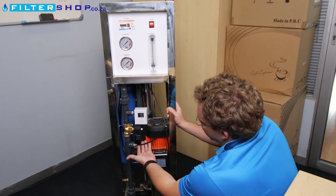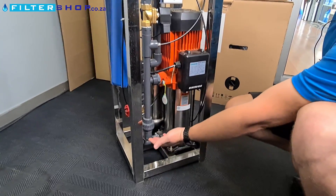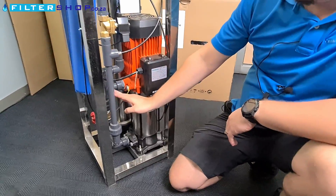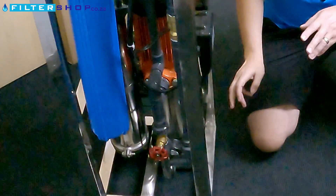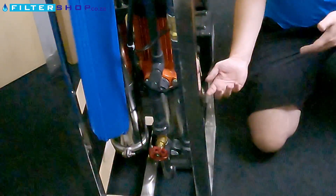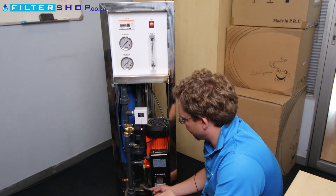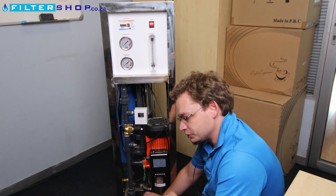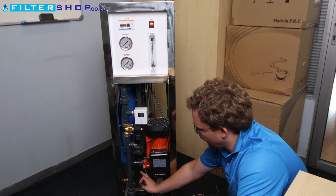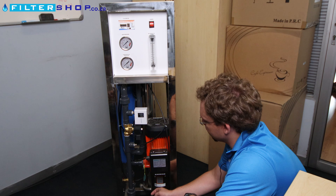From here, this is your connection for incoming pressure and the pressure gauge. Then it goes to the incoming side of the high-pressure pump. Out of the pump there's a split in two directions — one to a valve that feeds back to the incoming side. On these budget units they chose this approach: rather than throttling the high-pressure pump directly, you send some high-pressure water back to the source side of the pump to reduce the flow.